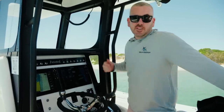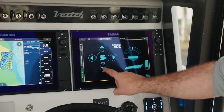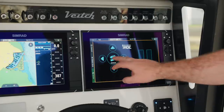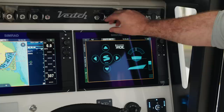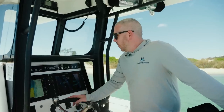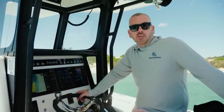Your Sea Keeper Ride system is all interfaced through your MFD — works with Simrad, Garmin, Raymarine, and Furuno. Most of the time you won't have this page up, but you can make minor adjustments while running. The middle button toggles auto and manual mode — press it to run it like normal tabs or put it back into auto. In auto mode you don't actually see on screen what your tabs are doing.